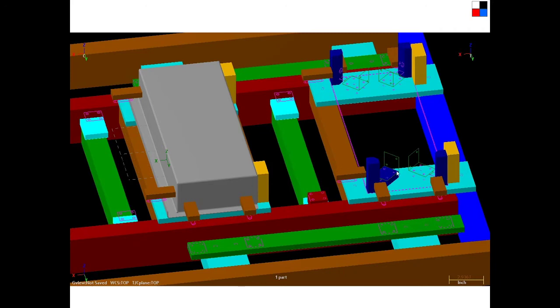Okay, now there's also something going on inside this part. So there's one of these right here. There would be another grease reservoir over on the right side. And some of the things we notice is that he has something that's inside that is pushing outward into the corner. So he's going to clamp on the outside of this with those Destaco toggle clamps, but then there's this blue thing that is pushing over to the side, and it's a little tricky to tell what this is, but you can see that he's got another drawing in there, and it's a drawing of 4 mounting points there and 2 mounting points on the back. And then you can see there's a little drawing of the end of a cylinder.